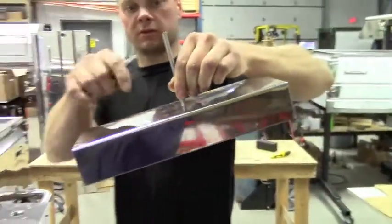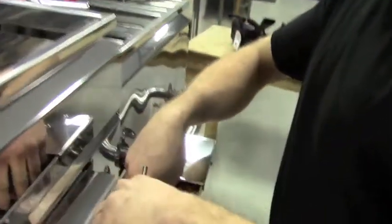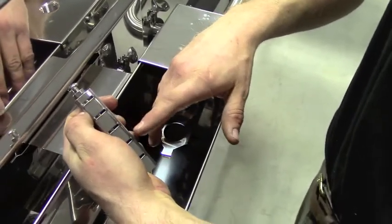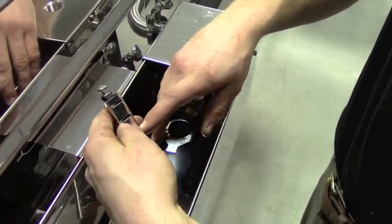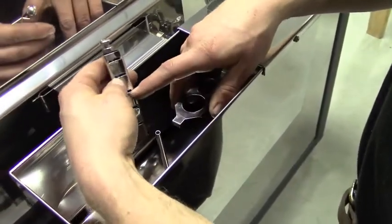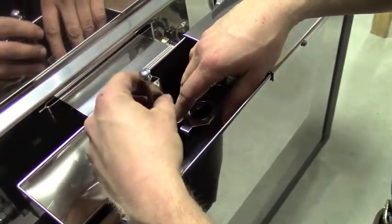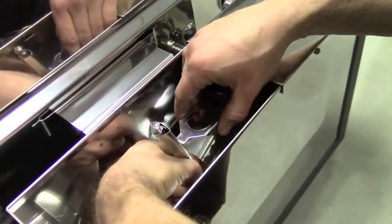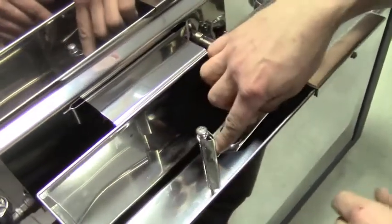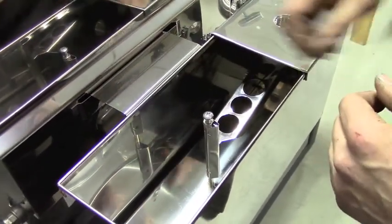So when I put that in, just take note that the long dimension here is what goes in under the valve arm. This is the regulator. These are your five major settings on the float box. You'll want to start your evaporator somewhere in the middle, which is going to give you about two inches above the flues or above the bottom of a flat pan. The regulator just drops in over the stem and you hook that in any of the settings. Those slots are your major settings, and this is your fine tune adjustment so you can dial it in to a very precise liquid level.